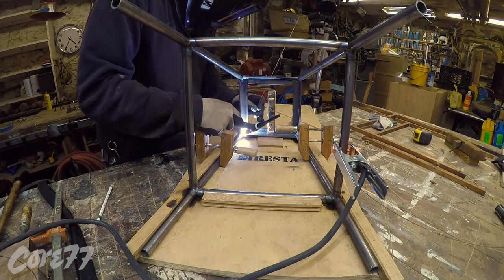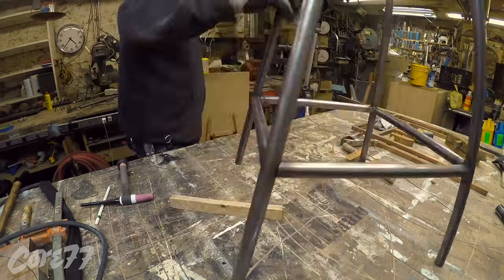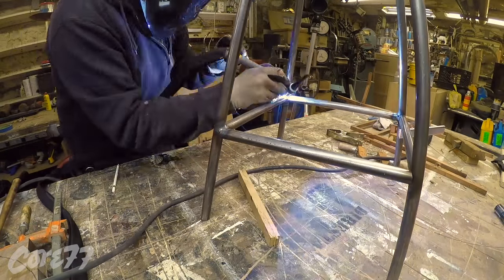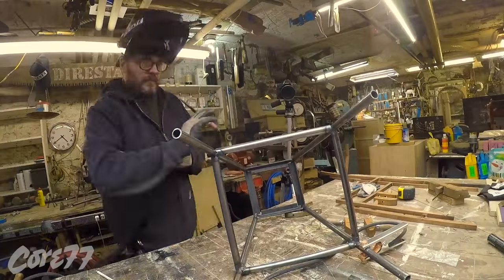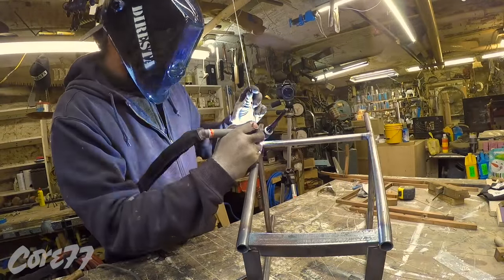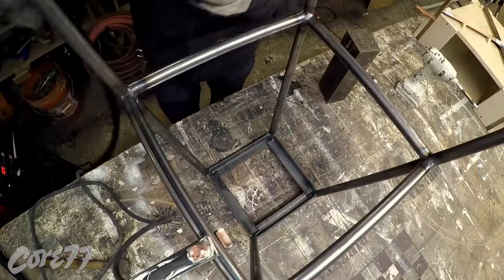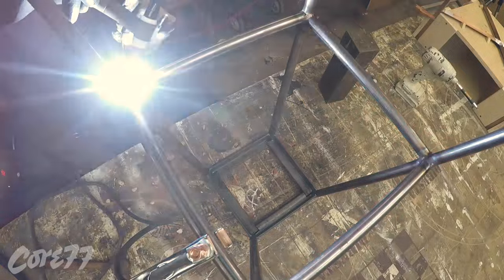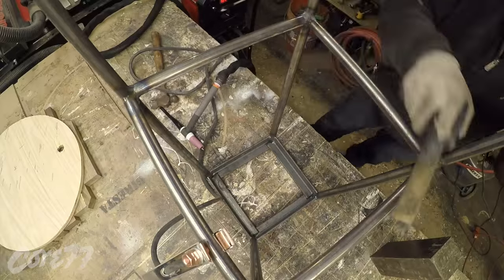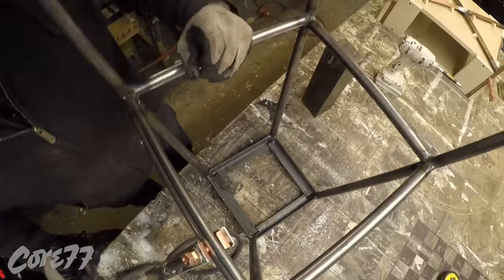Silicone bronze on the downstairs joints and the upper inside joints I'm using steel wire. And there I got everything done — and it sits flat on the table. So now I'm TIG welding with silicone bronze, getting the same part of each joint each time so I'm comfortable doing it. Now I'm back to each leg one at a time, and here I'm doing it from underneath. I keep doing each thing that's the same each time so I get good at it right away, instead of jumping all over the place. It also keeps you organized so that you know you've done whole parts of each joint.